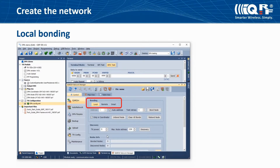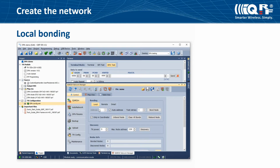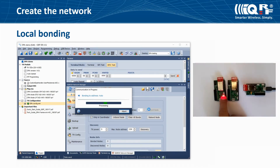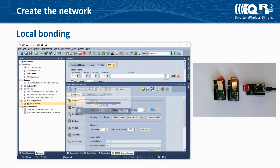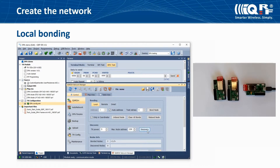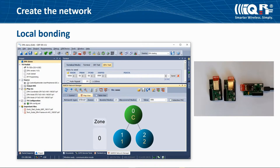On the control tab of the IQMesh Network Manager, select local bonding. In the bitmap you shouldn't see any nodes. If you have selected auto address, your nodes will get the lowest free logical address during bonding. Click the Bond Node button — you have 10 seconds to bond a node. On the DKFL board, press and hold the user button until the green LED blinks on the IQRF transceiver. Repeat the process with the second node. Place nodes on their final place and then run a discovery process. Set the TX power of the discovery process a little lower than in the configuration, then click Discovery. An optimally functional network with discovered topology will be prepared for data transfer.